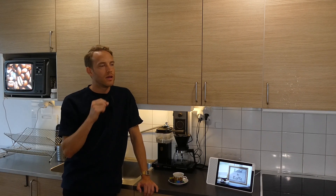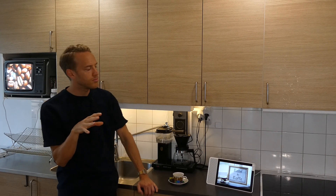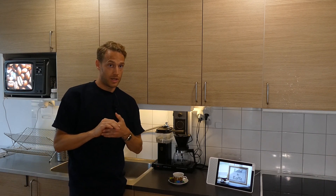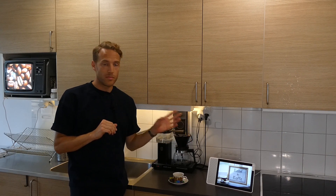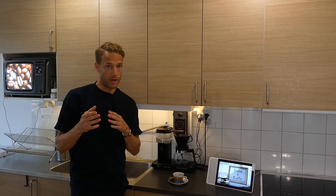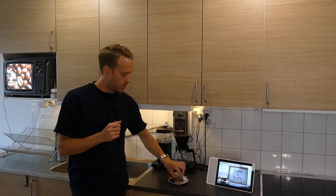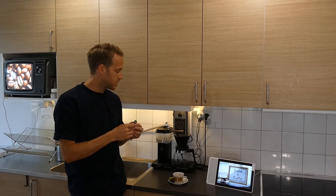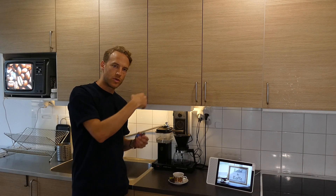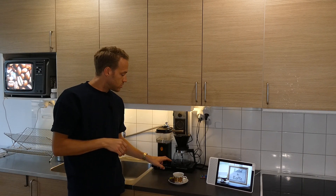This is my almost completely automated coffee brewer. The basic functionality is that I ask Google for a specific amount of cups, then my home automation server takes over. I'm running Raspberry Pi with OpenHAB, so OpenHAB fills the water tank and starts the coffee grinder. It's actually a modified grinder — I've installed a small relay so it starts grinding as soon as it gets power, without needing to press the button. When the grinder is done, OpenHAB turns the coffee brewer on.